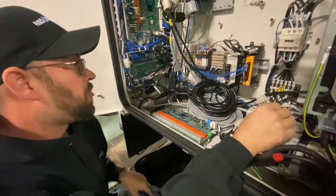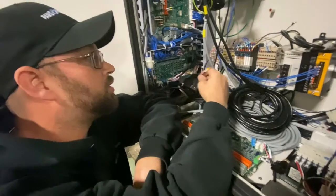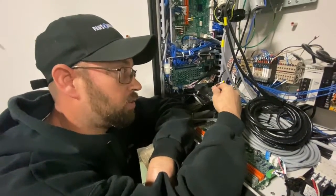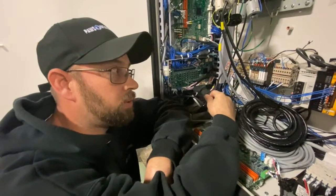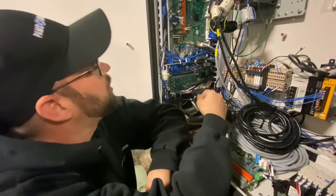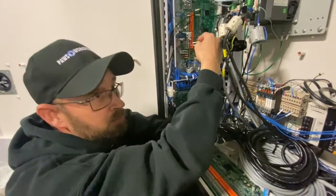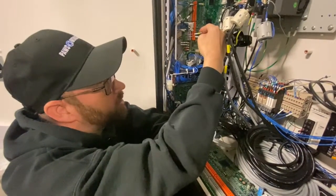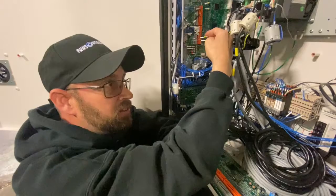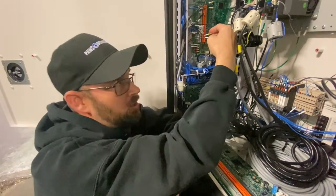After those, you've got two leads that plug into IO24 and IOG — it requires 24 volt from the machine to run the back side of the relays. Then we've got inputs and outputs. The two bottom are for your directional valves. This is what the M-code is going to use to turn the valves on and off, or tell which one to turn on and off.